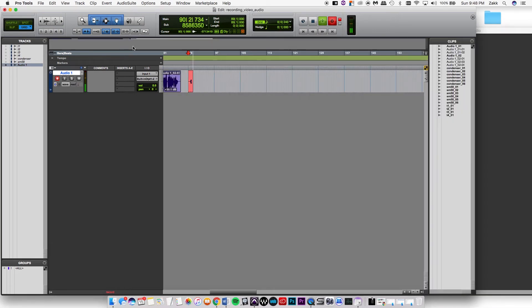The good news is recording too quiet is not as big of a deal if you have a good listening environment and decent preamps. But if you have a really cheap preamp or not one at all — like a mic to USB — more noise is going to be introduced when you boost the signal.